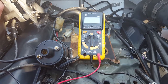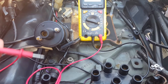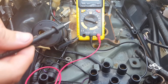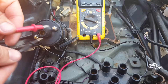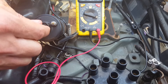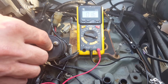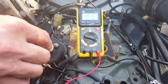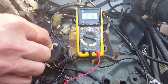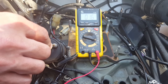You'll notice I have the carburetor off at the moment — we're going to do a video on how to rebuild that. At the bottom of your coil you have a plus and a minus. It's kind of important for the wiring piece, not so much for the testing today. The polarity isn't that big of a deal for this test. So plus and minus — this is on your low side. Currently sitting at 1.6. For this reading on your coil you need to be anywhere between 1.4 to 1.8. You see it fluctuates a little bit as I apply more pressure on those bolt heads — 1.5, 1.4. This is all fine.